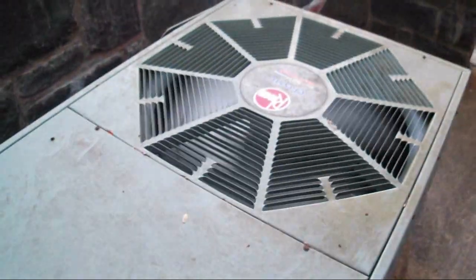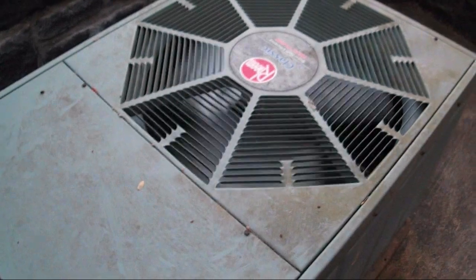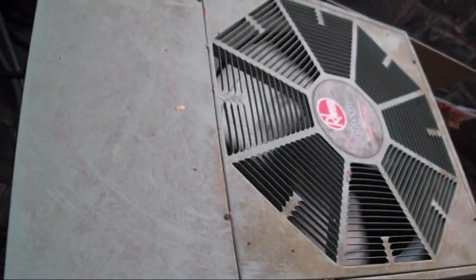The line is hot, so it is obviously running in heat mode if the suction line is hot. I would say it is in the 40s or 50s and it just shut off. Yeah, it is chilly but I think it is a little too warm to get a decent defrost cycle. Very nice unit in my opinion.